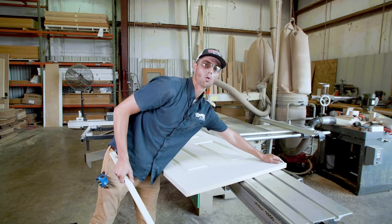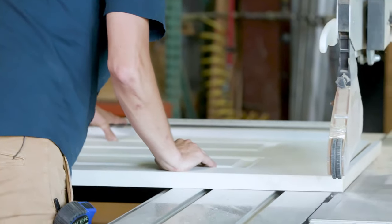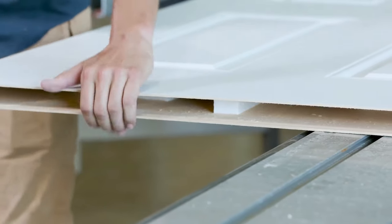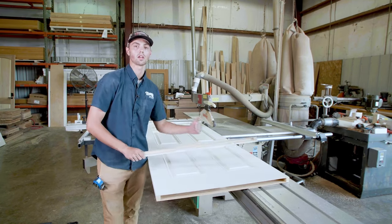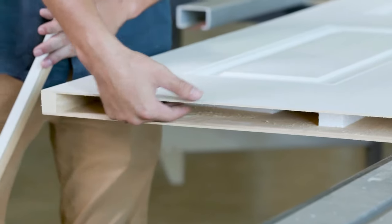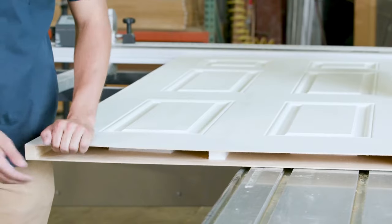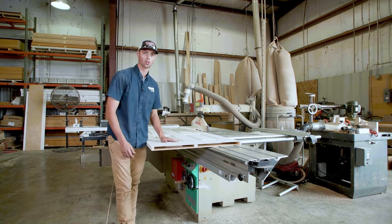Let's cut a little bit more off — about an inch this time. On that last cut, we did get into the hollow core part of the door. This is why this is an entry-level door. Here at Baird Brothers, when we get orders for hollow core doors that need to be cut down, we simply cork it with a wood cork. At home, that may pose a problem if you don't have the capability. Let's tear this apart and see what the inside actually looks like.